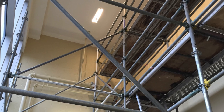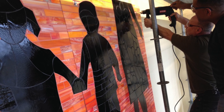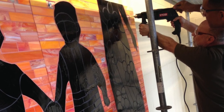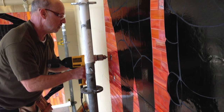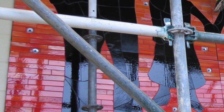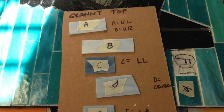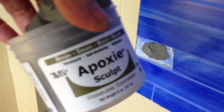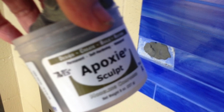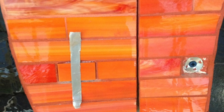The individual panels were easy to transport. The job required some intense scaffolding and lots of safety measures. A hammer drill was used for the initial screw holes — the wall is concrete block. Washers and flathead screws were placed per building code. I pre-cut glass pieces to cover the screw heads and used epoxy to attach. This was much easier than using any other adhesive — no drips and quick setting. Once cured, we did grout patches and simple cleanup.